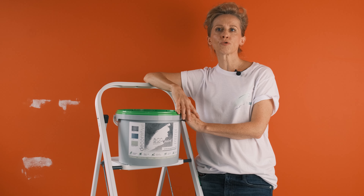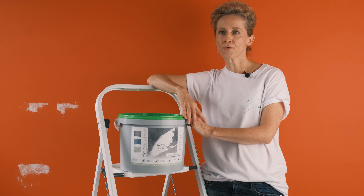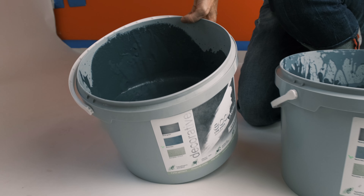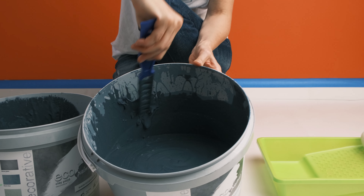To find out how to prepare the substrate for painting and how to mix EcoPaint paints, I recommend watching our video on general clay paint application. This is what the consistency of the paint should be after mixing in the recommended proportions, after a 3-hour soaking period. The correct consistency should be similar to cream — I added an additional 40% water to achieve the right density.